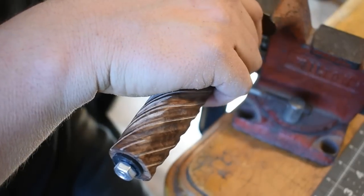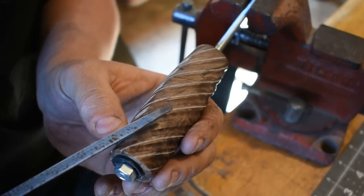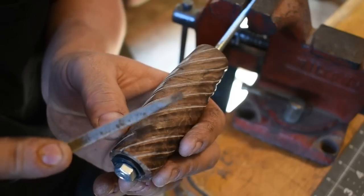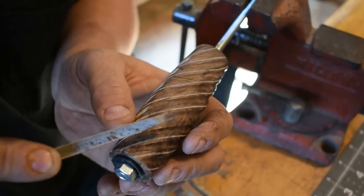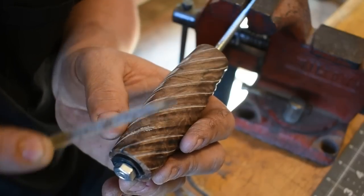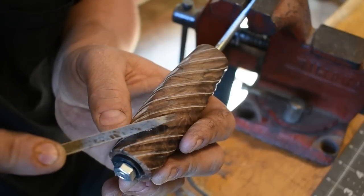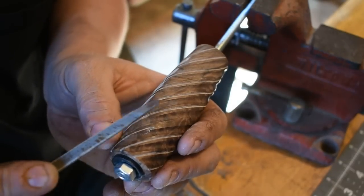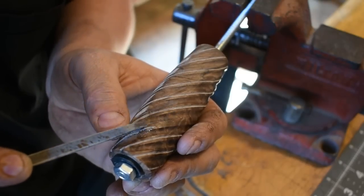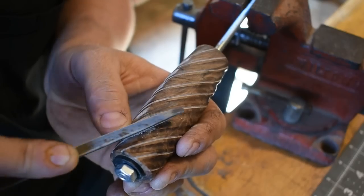And then we'll loosen it, turn it around a little bit, come back in, and start chasing it over. Like I said, just take your time, get your first groove in there. It doesn't hurt to go over it a few times just to get it a little bit deeper. That'll help the saw ride in it better. And just try to get them as centered as you can. I tried. They're not perfect, but as I clean up the in-between areas with that little drum on that other tool, it'll kind of straighten them out some. All right.